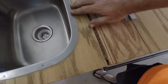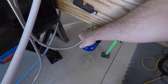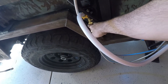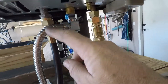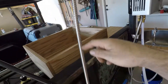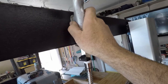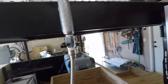That covers the switches, power, and plumbing. I went through and did some wood putty on the surround here because I didn't router it well enough — turned out all right, not the greatest but it's a camp build so I'm fine with it. Underneath, we have the hot going into the faucet and the cold going over to the main water source. This water line goes to the hot water source, feeds the faucet, and also feeds the shower over here.